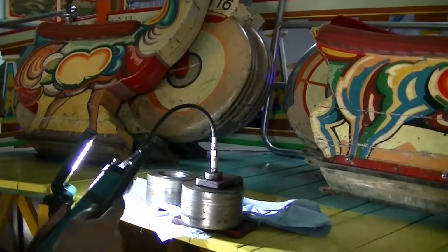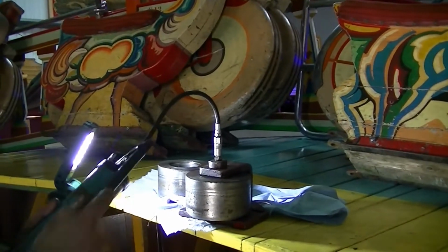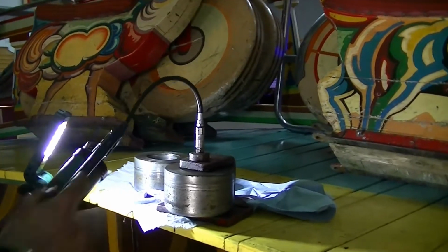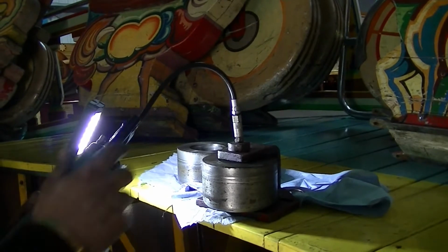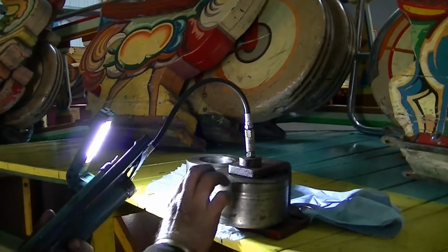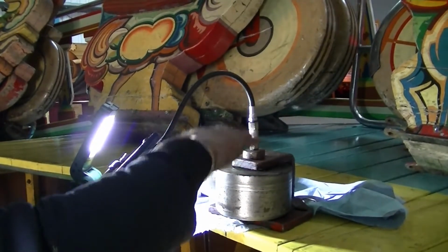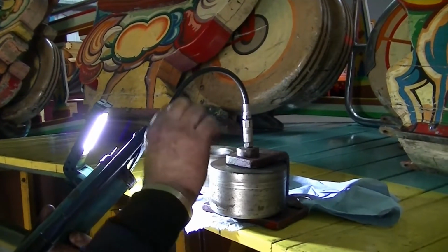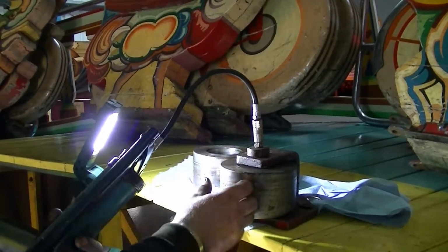Sealed bearings, yeah. You obviously don't have to grease them really now because they are sealed. But you still got a collar in between that wheel. You got a piece machined out at the top for the bearing to sit. And then there's a little sleeve, which is like a center riser for the pin to go down through.